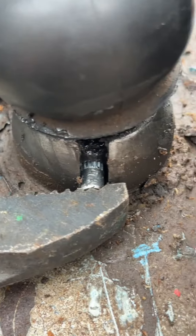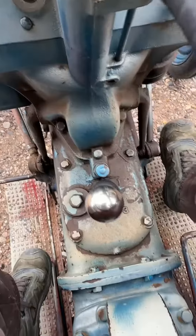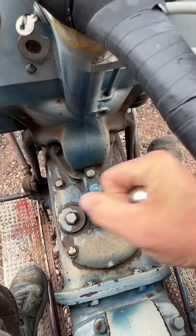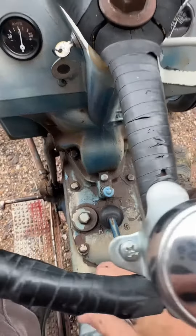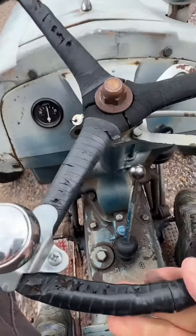Ideally, you'll want to press the pin all the way in. You'll either need to remove the cover on top of the transmission to do this, or add a spacer smaller than the notch between the end of the pin and the tool you're pressing it in with — in my case, large channel locks. I'll want to easily remove it next spring as I disassemble and restore the tractor, so I'm not pressing it all the way in this time.